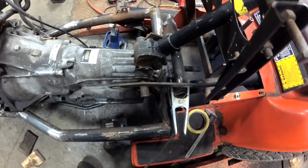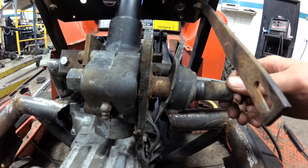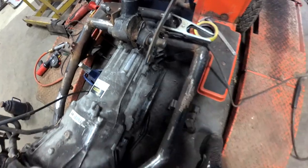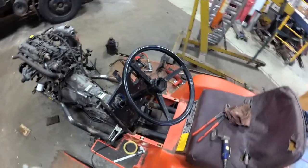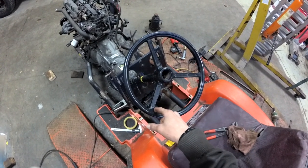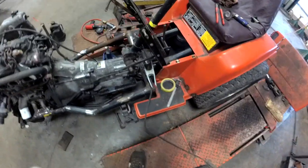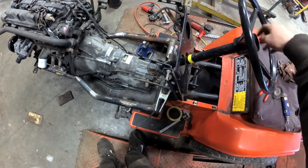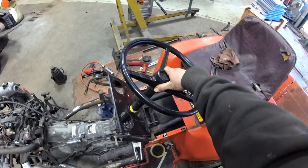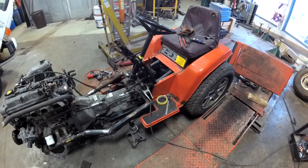She works. I think I might take this box apart and have a look at rebuilding it because — yeah, see the play. That's not gonna be good for steering. I want to get as much play out of everything as I can so this doesn't act like a mower. When the mower was stock it had about that much play before you'd actually feel anything. The steering box itself doesn't have hardly any play — it's about equivalent to early 2000s GM trucks. I'll deal with that. It's fine.